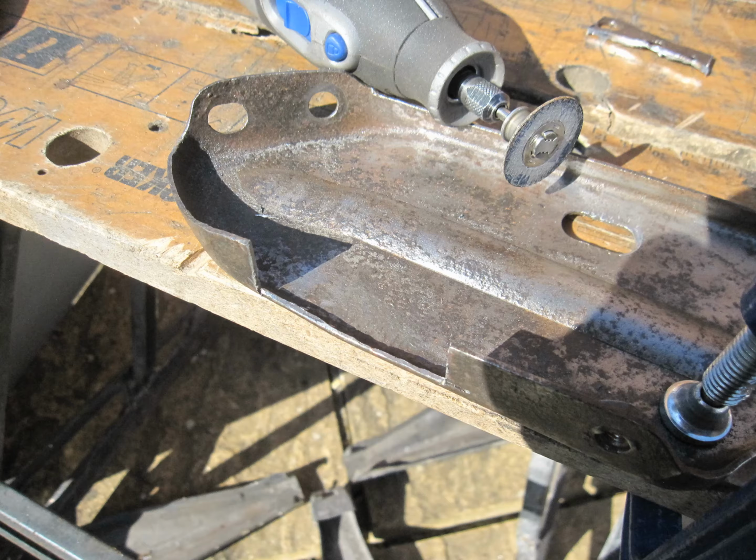This welded insert is beyond any easy repair, so I'm going to cut away the original welded nut, complete with the rusted end of the bolt. I've done that, and you can see the remains of the insert here. Cut away from here.